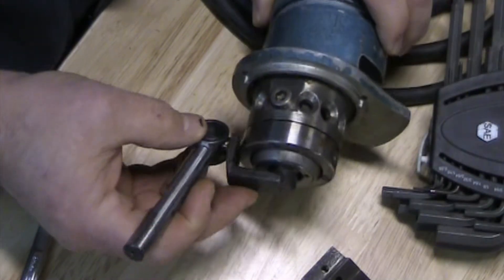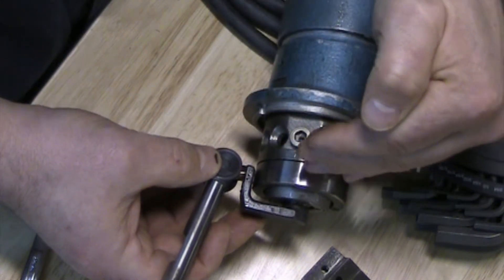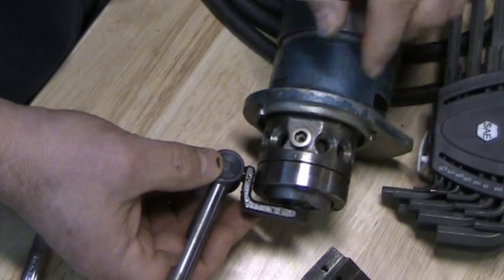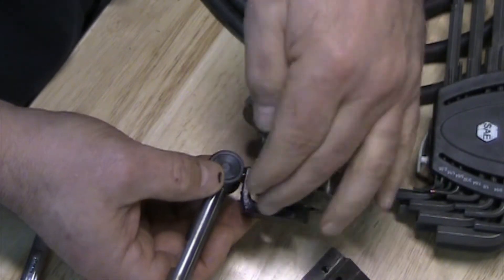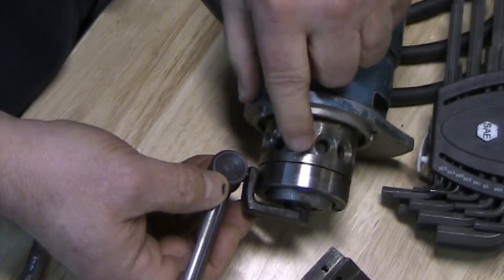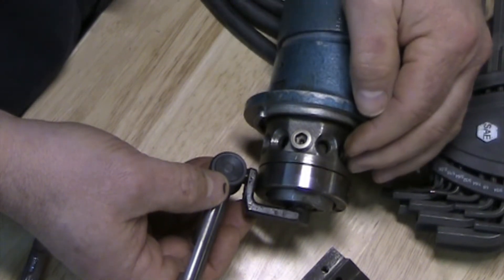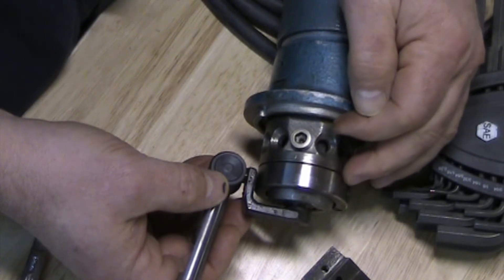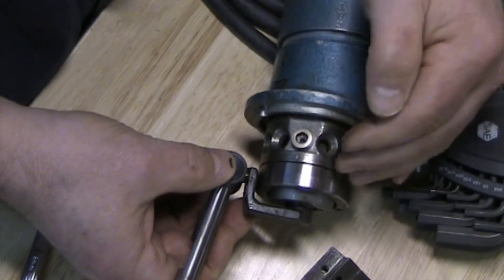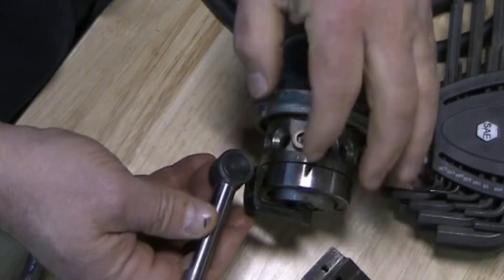The other follower is connected to this arm here. When the swash plate is perfectly 90 degrees and you turn this on and it revolves, there's zero displacement of any of the associated elements. As you go ahead and influence the socket head cap screw — turning it clockwise or counterclockwise — you introduce an offset onto the swash plate so that as it turns around, it constantly rocks back and forth.